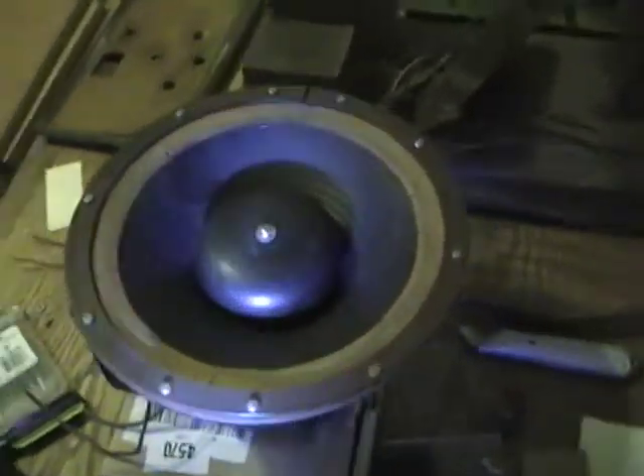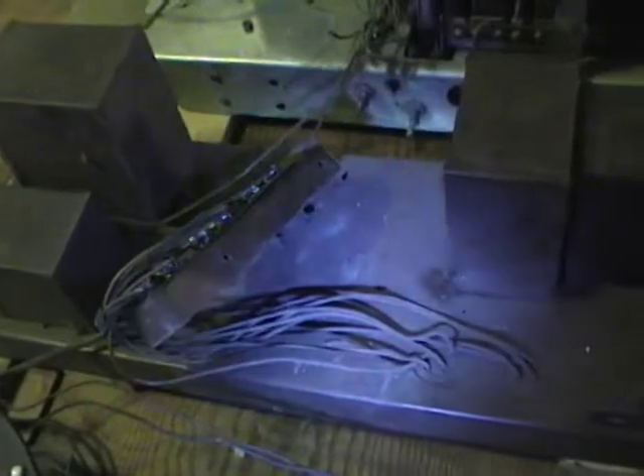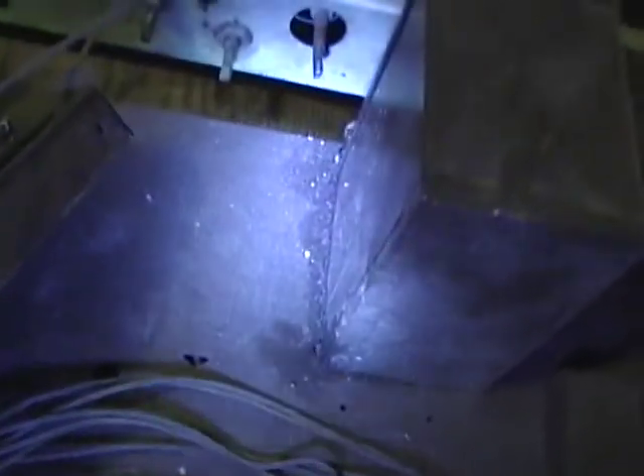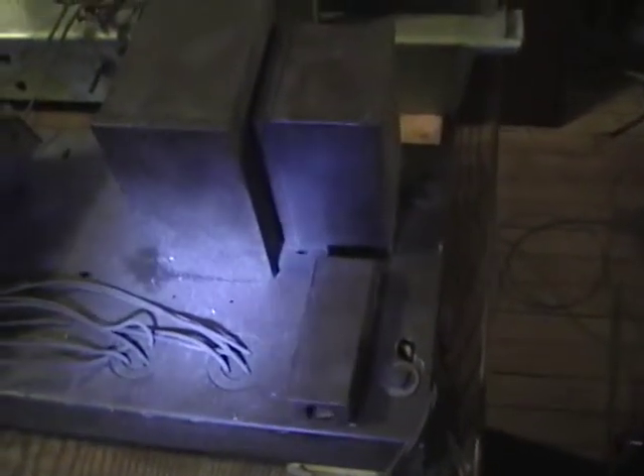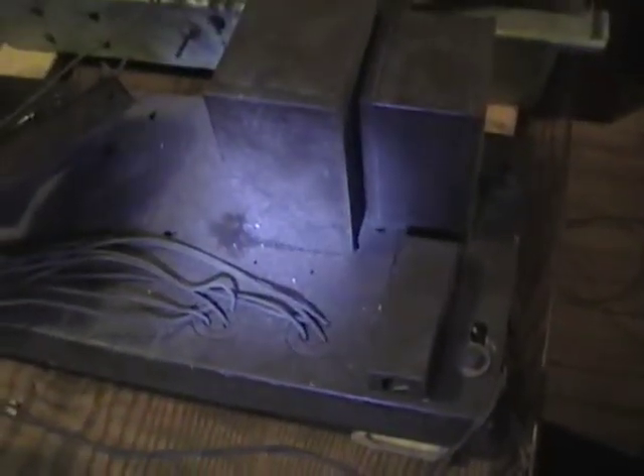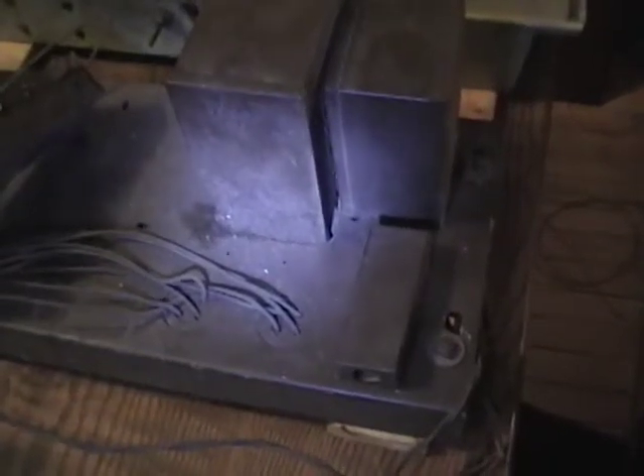Here's the speaker I already repaired and restored. Here's the main power supply and audio amp chassis. I've since learned that this is actually the main filter capacitor — there are three or four capacitors in this large metal box. Now even though the radio does work, these will go bad eventually and I should replace them. I've also noticed some discoloration here which indicates some leakage of the wax that these are probably using.